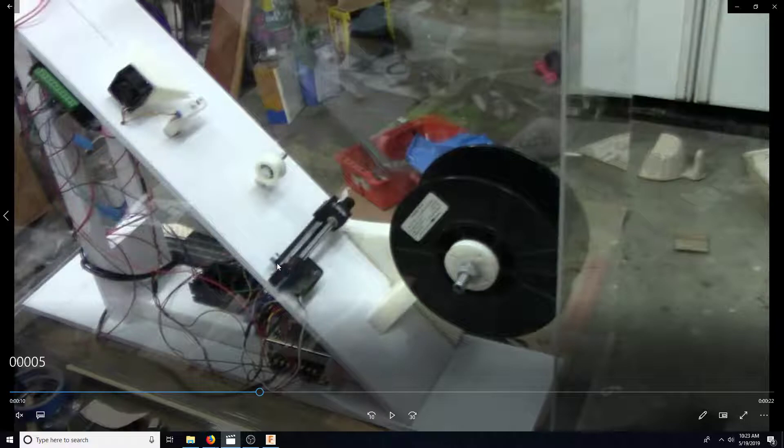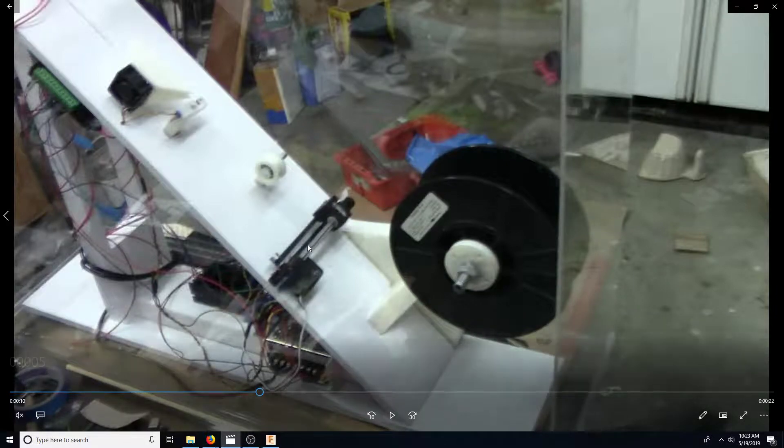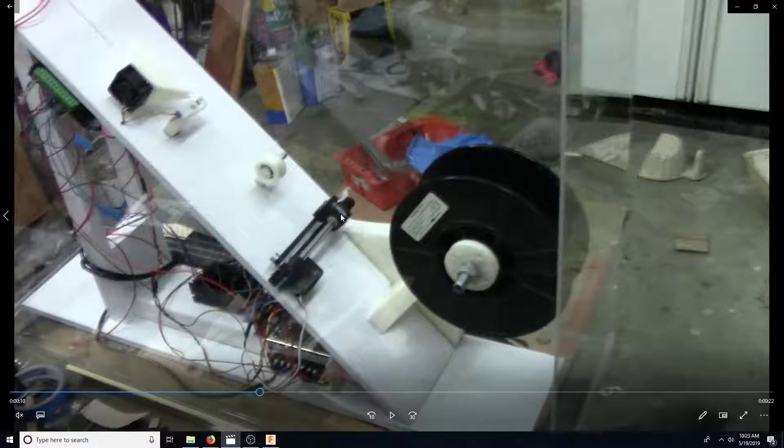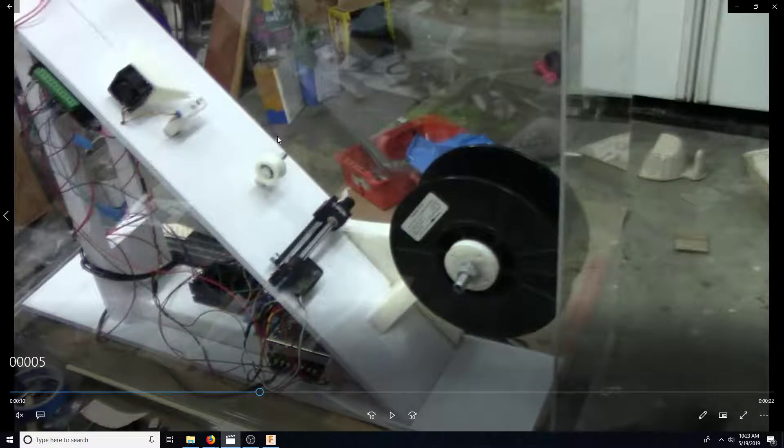It has a regular 16-tooth pulley here, a 16-tooth idler pulley on the other side, and a carriage that goes back and forth with a Delrin bushing on the inside. We made a little wire eyelet and glued it into one of the holes on top, so the filament goes through the eyelet, goes under this pulley, goes up through the eyelet, and then starts wrapping over the spool. Everything here is in line from the nozzle — goes through the fan shroud, through the dimensional control, under the pulley, over the spool.